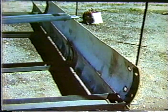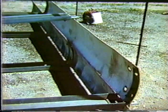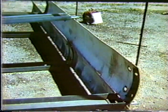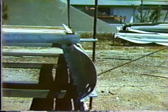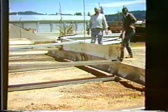And then if you really think about it, this system looks very much like one of the original facings that the Reinforced Earth Company had for their product. So here we're combining salvaged guardrail on the front face with this rub rail and coming up with a system that potentially could work. I must admit at this stage that none have actually been built. This was something that we were playing around with, but certainly with a little bit more thought to it, low walls could be built with this system. And basically they're all salvaged or waste materials. And this is what we conceived as how the system would go together.